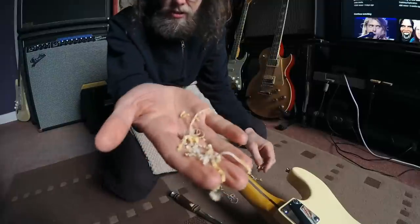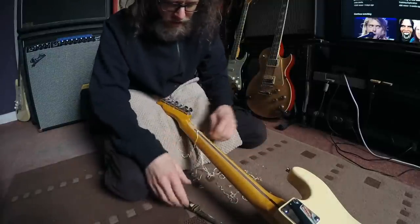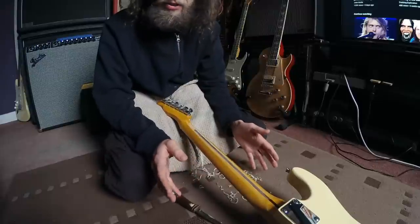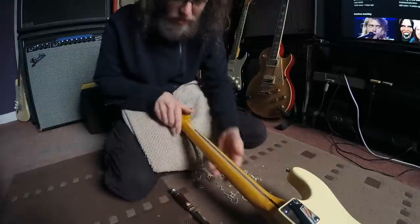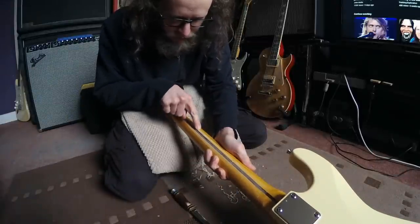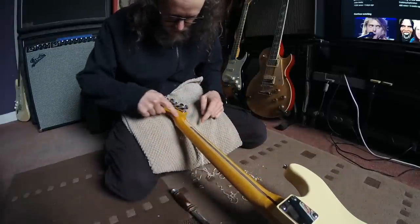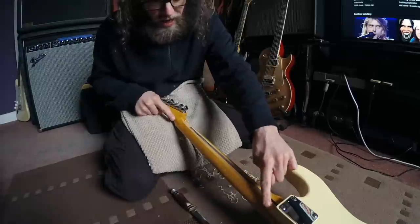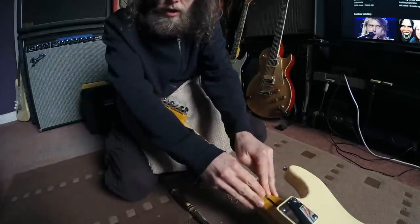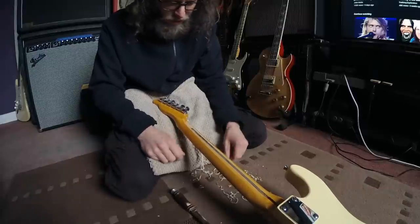It's just really thin, delicate slices we're taking off. We're not after doing it in 5 minutes. I want to be at this for a good few hours to get it right. And I don't know if you'll be able to see this, PewTube, but you can see the difference in colour where the real wood's starting to poke through in comparison to the lacquer bit. But that's what I'll do. I'll take it up to the loop up here from this one down here. I want to remove all this section here. That's all I want to get rid of. And then once that's done, I'll sand it and just finish it off, really.